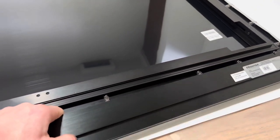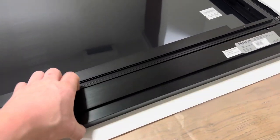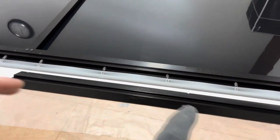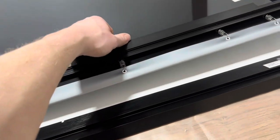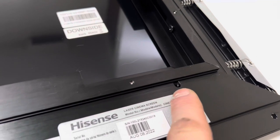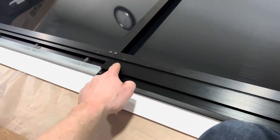Pretty easy — lift up there and then tuck this in so that lip goes on the other side of the screen. You need this lip to hug the screen, but you don't want it to rub too much against it as you slide it in. Lift the screen a tiny bit from this rail like this and tuck it in. You can see this is completely lined up with this edge right here, and we have little screw holes — go ahead and put those screws in right here to hold that piece, then go on to the next and the next. Leave these loose until the very end so you can shift things around if needed.